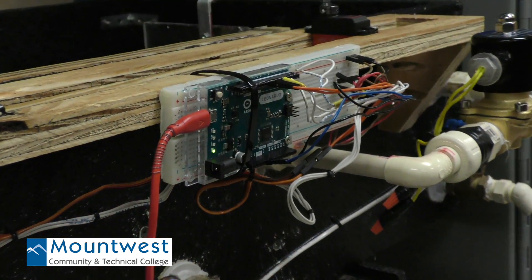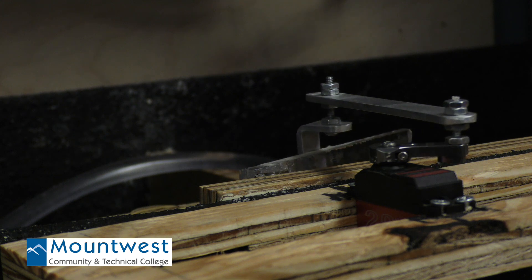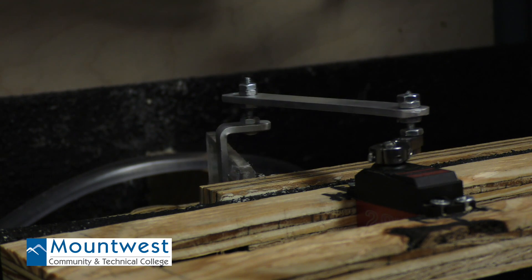We basically wanted to run off the PLC system for the whole thing. A big problem we encountered is with the doors — we needed to use smaller servo motors to operate the doors and we couldn't program those into the PLC system. So we had to use what we call an Arduino, which is a smaller chip, and that's what's operating our doors. To do that we had to use a four-point time delay in programming. We'd never done it before so we had to do research into that, and I'd say that was our biggest problem — doing something we'd never done before.